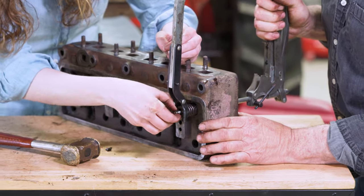We sprayed our gasket with some copper high temperature sealant and we recommend that you do the same. It's definitely what we prefer and have done for years and years. So you can press your head gasket down into place and then you're ready to set the head on. I can't stress enough how important it is that your surface is clean before you do this. You've checked your head over for warpage or cracks or anything like that. You're ready to set that down.